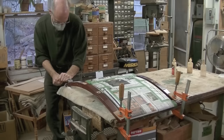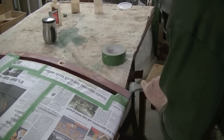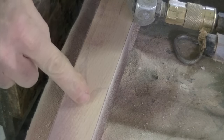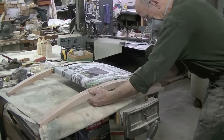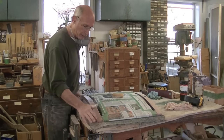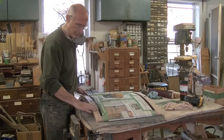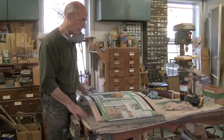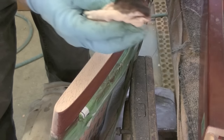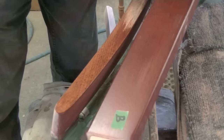What I'm going to do now is tape off this inner part and sand down and refinish both side pieces here. You can see this is where the cracked piece was glued up, and it's important to sand it till it's completely all the same color. After sanding with the orbital sander, now I'm sanding by hand — I'll sand with 100 and then 150. It's important to make sure there are no orbital marks. I've sanded it really well to 220. This is a hard wood — it's like beech or something like that. You need to make sure it's really smooth so that the stain is as even as possible. I'm going to stain this first with a dye stain, light red mahogany. Comparing it to my piece of the chair here, I think it's going to be okay — as long as it's a bit lighter than this, I'll be good.